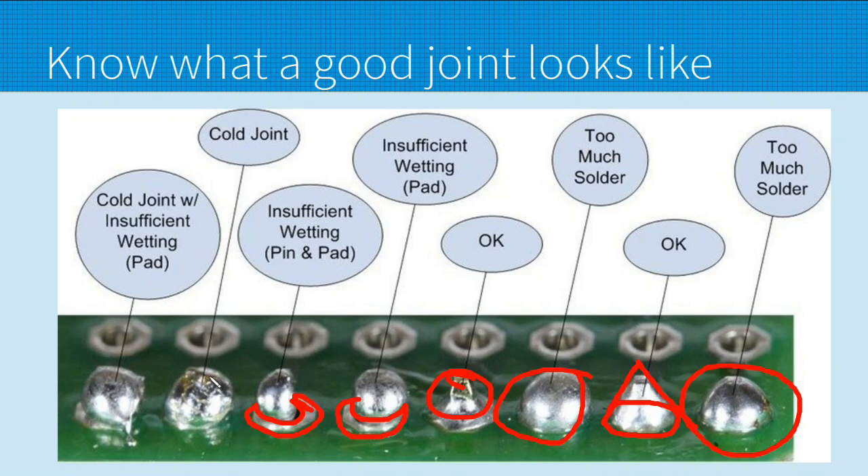That's barely in there at all — that's going to work loose. Now this is a cold joint, which means the wire poking in the middle is not really connected to the solder, and that solder is not really connected to the pad. You're not going to get a good electrical connection out of that, even though it may provide a mechanical connection — you might be able to pull on it and it won't move, but the electrical connection won't be good. Know what your joint should look like: a shiny mountain. All right, that's all I've got — if you enjoyed this please give me a thumbs up, comment, share, and don't forget to subscribe. Big thanks to all the patrons and to you guys for watching!